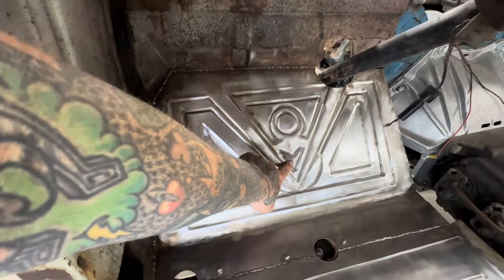I've already used a piece of tape to mark the existing piece so I can have the same measurement on one side as the other, making it look uniform. Now I'm going to use a yardstick, make a straight piece, cut it out, and mark the halfway point so I know where to break it. I'm going to use the Beverly shear to trim it up and get it ready for the brake.